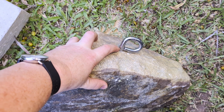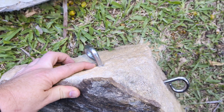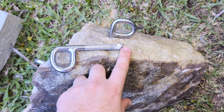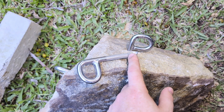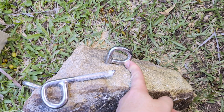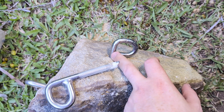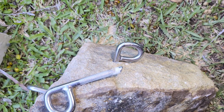I wasn't able to actually extract any of these by torque. This one rotated around quite a lot — the glue has just lost cohesion with the rock completely. And this one was basically twisting the steel around. So as long as the steel is in the glue I don't expect the whole thing to fully rotate, because the little wedge at the bottom should really prevent that. Regardless of whether any glue along the knurled part has sheared off, that part should still be stopping it from rotating. That said, according to the standard, this one still actually failed because it did move. Recessing the eye properly would prevent pretty much any movement at all. Not being recessed means there's going to be a little more twisting, maybe some bending of the shaft where it meets the rock, a bit of metal fatigue — things like that.